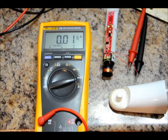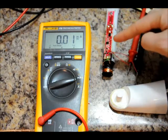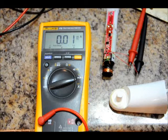Just be careful to disconnect the battery before you take your measurement. If you have the battery connected in the same configuration I have here, you'll short circuit the battery. These rechargeable batteries have relatively high ESR — internal resistance — which will limit how much current can be sourced, but if you don't have your multimeter configured for a higher current range, you can burn a fuse.